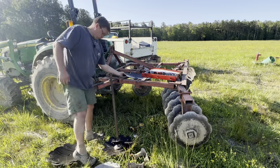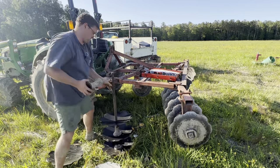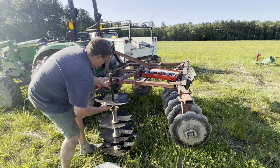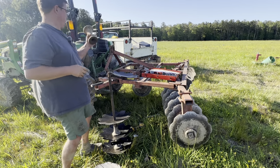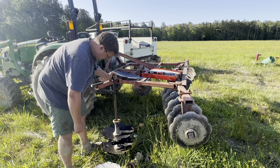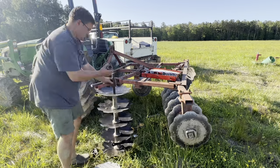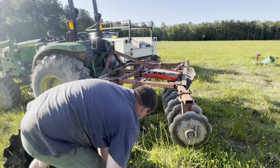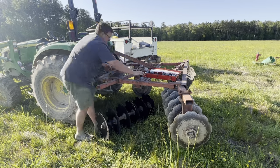If you keep watching, I'm not putting the spacers on the correct way. So I'm about to have to pull it apart again, because I've never done this before and did not know what I was doing when I got started. Apparently there is a very specific way these things go on there — would have been nice to know that beforehand. So at this point I'm just restacking the discs, the spacers, and the gangs together. Those spacers have a small end that's concave and goes on the inside of the blades, and a larger end that goes on the outside of the blades. If you look at it, you can kind of tell.